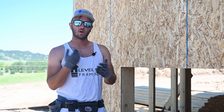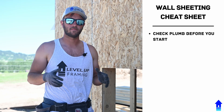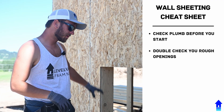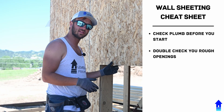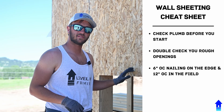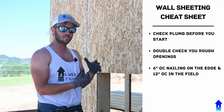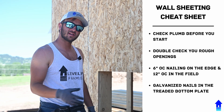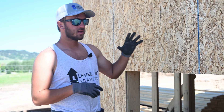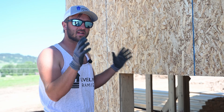We sheeted this wall — hopefully you guys got a lot of value out of this. Just in recap: before you sheet a wall, always check plumb every time because once you sheet it, it's not moving. Also check your rough openings before you sheet them — it's way easier to fix it before you sheet than after. Six inches on center nail around the edge, 12 inches on center in the field. Feel free to put more nails in to tie things together, like the wall to the floor system. Don't forget to put galvanized nails into that bottom treated plate and you should be good. Be sure to check out our video about tying decking up here, and if you guys got any value out of this video, be sure to subscribe because we're doing a video about every skill it takes to frame a house.